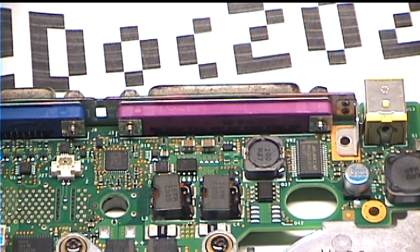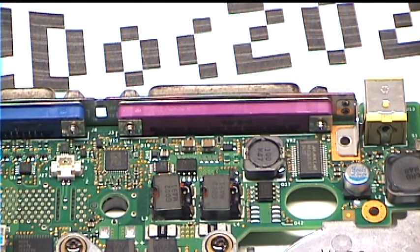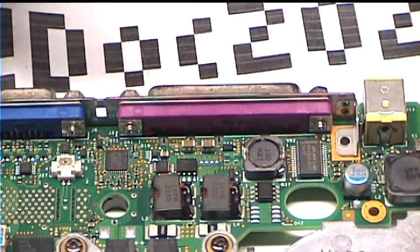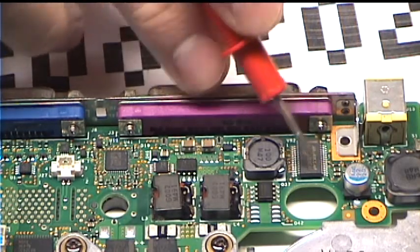So from this blog post, the person, I think their name's Igor, had the exact same symptom with the Max 1631 that wasn't turning on. They tried replacing the chip and it didn't work. They had an oscilloscope connected when they plugged it in and saw a quick blip. The 5 volt that this chip also does looked good for a few milliseconds, and the 3.3 volt rail, the one we're looking at, had a crazy amount of ripple for those few milliseconds. I thought maybe it was tripping the overvoltage protection in the chip.